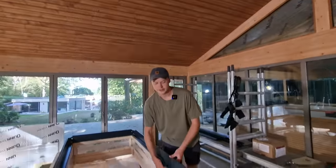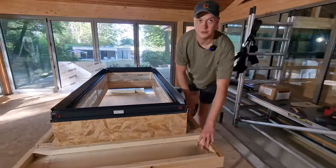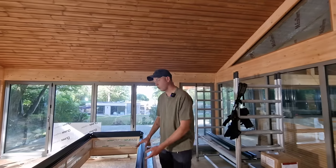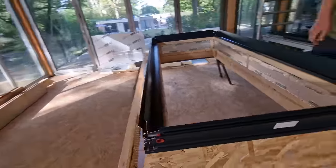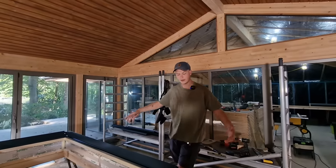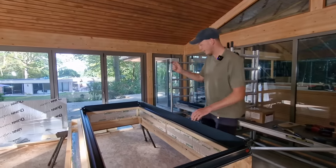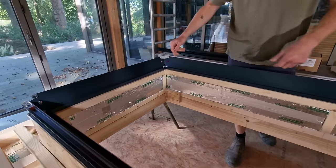It is now insulated. You can see the insulation going all the way around in the upstand and in the main frame itself. We used Gapotape, so we just take 8mm less of the aperture to fit the Gapotape. The Corniche eaves beam has been placed on top of the upstand. We also have an overhang from the Corniche to the upstand of about 6mm all around, because when we add our Alwitra we want some space so it finishes flush when the Alwitra is on. We've added some cleats on the inside and removed some screws to make it easier to install later, so it can literally just drop in.